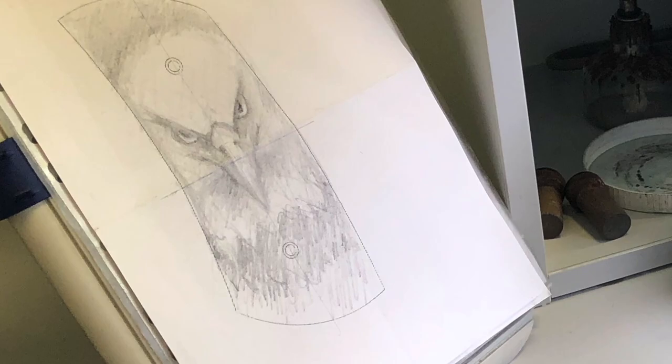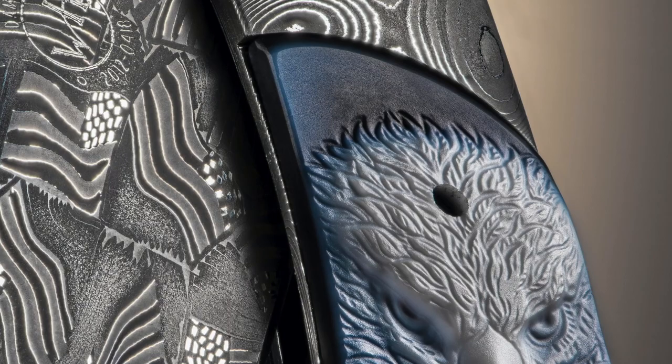At this point, once we've gone through the learning curve, we have the privilege of working with one of their principal in-house artists, whose name is Anya. She develops the original artwork in collaboration with William Henry for the carving to be done on the banded agate or jade. That original artwork is hand carved into a steel master — a reverse, negative image — which is heat treated. Then under a press, that steel is pressed into copper to create almost like a copper electrode, a perfect rendition of the artwork. Through this technology they've developed, they use that copper piece to ultrasonically carve to very precise depths remarkable detail down into jade or agate.